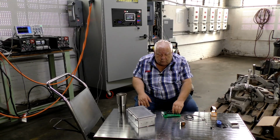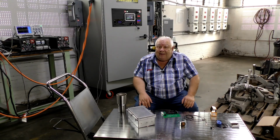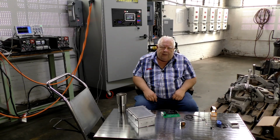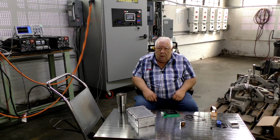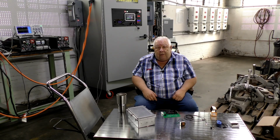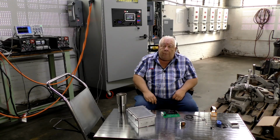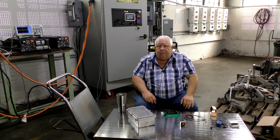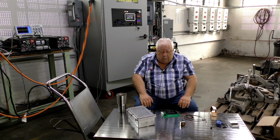And we're going to use this to measure power at the mains, the AC power. And we're very accustomed to measuring flows and so forth in DC, but in this case we're going to do it with AC. AC, of course, doesn't really have a polarity, and it doesn't really have a direction. The current flow is forward and backwards. However, when you use it to power equipment, you'll find that the current lags the voltage just a little bit, and so we can use that to detect the direction of the actual total current flow or power into or out of a device. In this case, our AC grid main entrance, or our PowerSafe 100, for example, output.